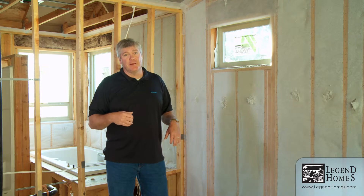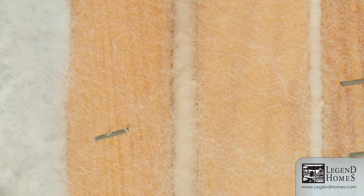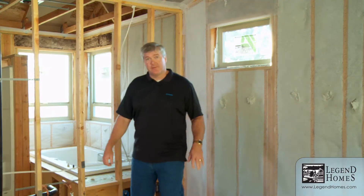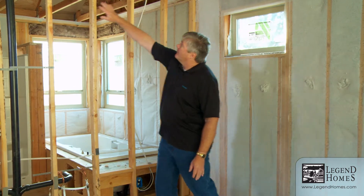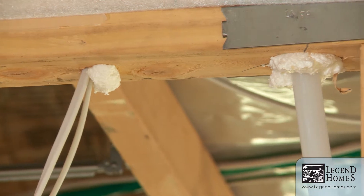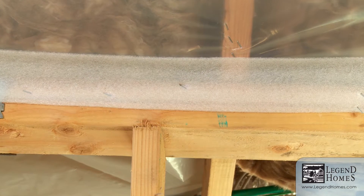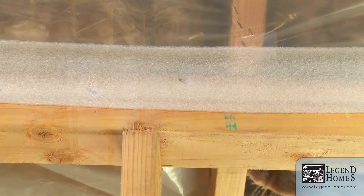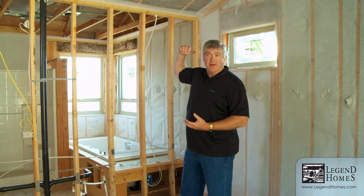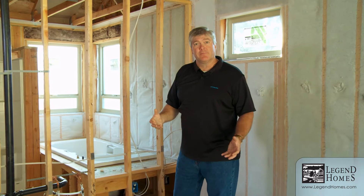Some of the air sealing details you may not have seen in the past: we're going to have foam or caulk between big gaps and the studs on the inside to the exterior wall that you see right there. Around the pipes in the floor and the pipes in the top plate, we're going to have foam insulation and caulking to seal any holes. Up at the top of the top plate, there's a foam gasket that's going to compress against the drywall as it attaches, keeping any air from the attic space or that may have dropped into the walls from getting into the airspace of the home. So we've got control of all the air moving into this home.